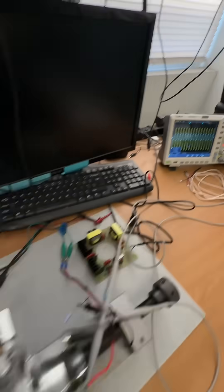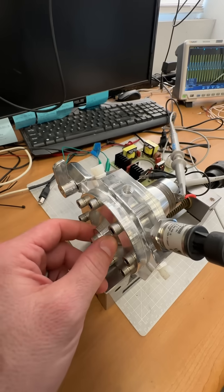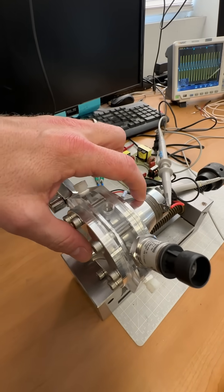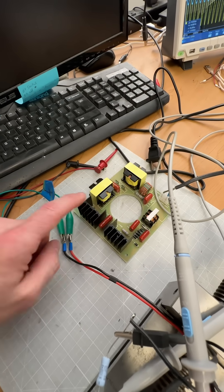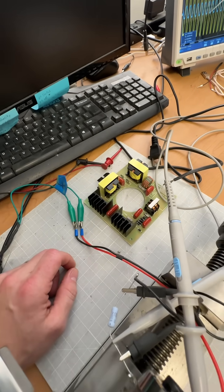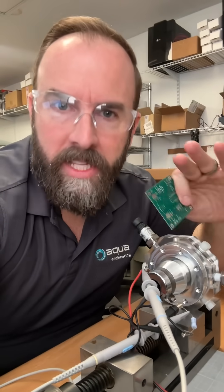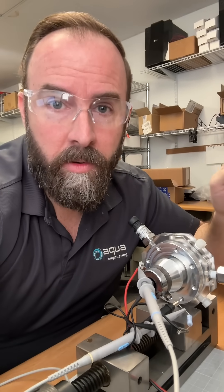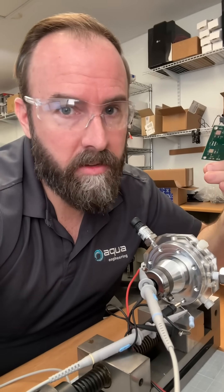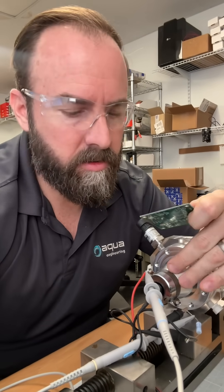That activity should be happening at 40 kilohertz and it's not. So we fundamentally have to remachine this — probably to get a half wavelength across that sphere diameter. One of these off-the-shelf drive boards uses what they call a Jensen topology, and it's difficult to inject a signal into that from a microcontroller. I want complete waveform control for these transducers because I want to do creative stuff in the frequency domain. So I'm probably going to do ESP32 to a Class D audio amp, step it up with a transformer per transducer — one to 200 volts.